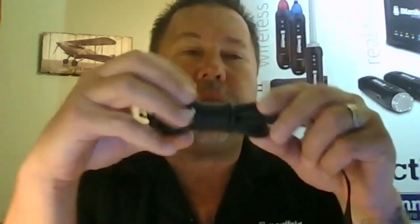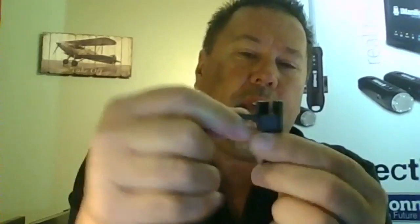Now your system comes with these strap probes. The way these strap probes operate, you can see there's a little V cut up on the top here. It simply goes onto the piping, comes around, and you pull it tight. Once it's pulled tight, it's on. Very simple to release. Just pick up on it, and it comes right off. So these are going to be plugged into the side of the probe here.